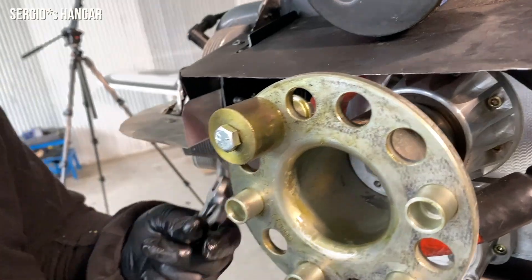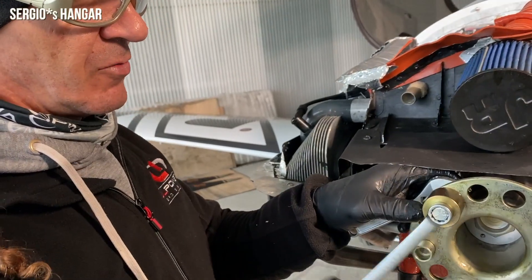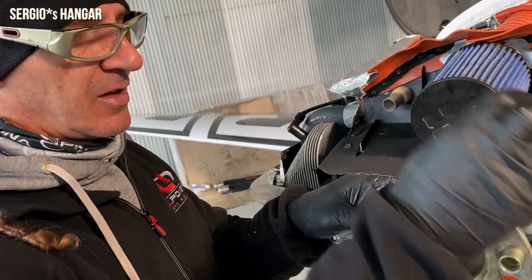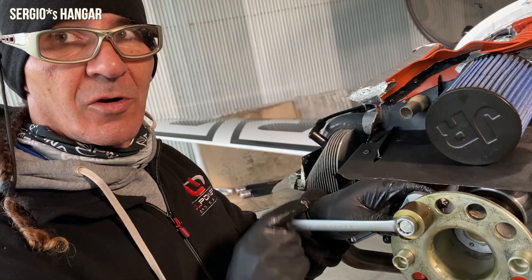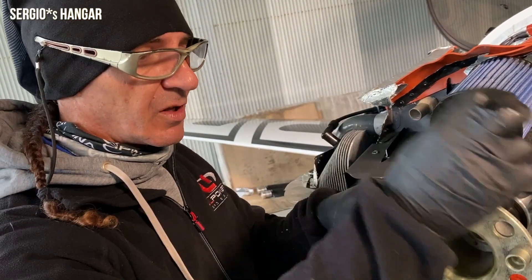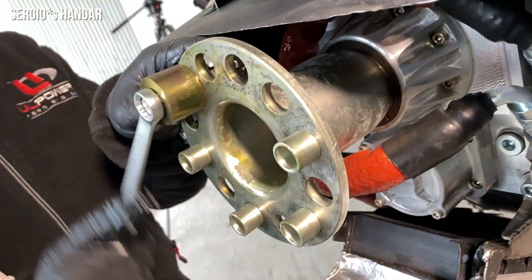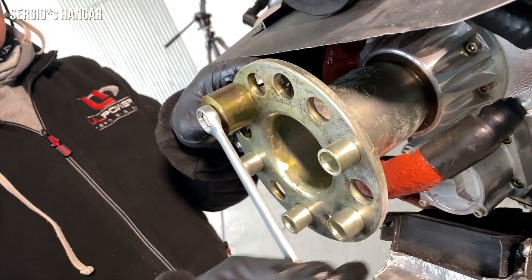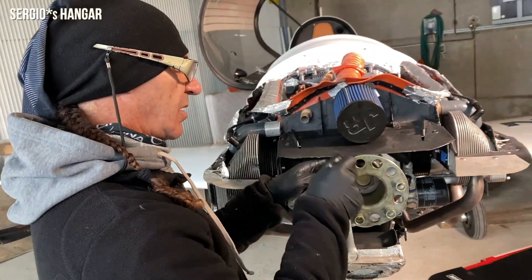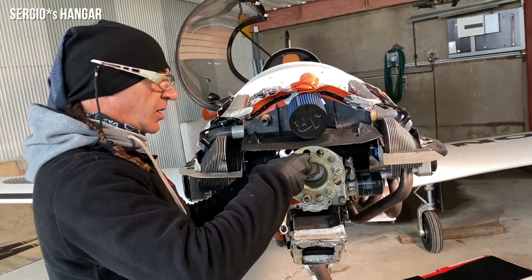So they have to fit really, really tight. The bushings are the ones that make the forces. That's why many pilots over-torque their bolts — it's not the bolt that does the job. The one making the job is the bushing: these six bushings plus the centering bushing make the turn. The bolt just keeps the propeller in place.